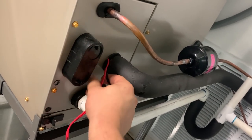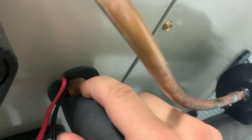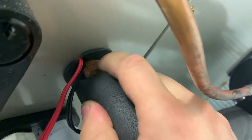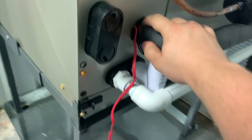Two, we've got our electrical coming in through here, but if you look closely, there is no insulation on the inside, so it's rubbing up against the discharge line in heat mode. This is a heat pump. We have a potential for wire rub-out, which would cause the system to shut down. We would have a low voltage short to ground at that point.